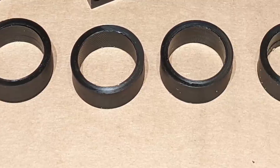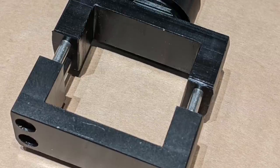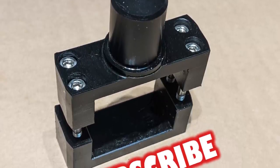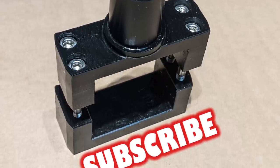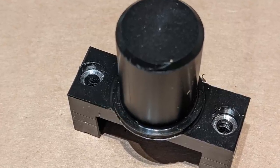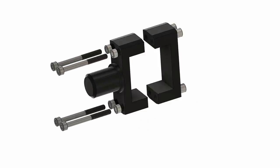So that's 6 anti-split collars, 4 small saddles, 4 small spigots, 2 large spigots and saddles, 8 long threaded nuts, 8 short ones, 16 plain inserts, 8 long bolts, 8 short ones, all ready to ship. They'll be holding those 2 damn great big Yagi beams high in the air in all sorts of weather, sending big signals over extreme distances, and maybe even winning some radio contests.